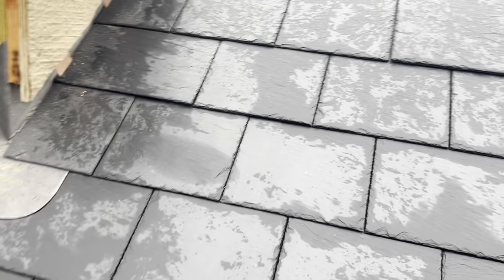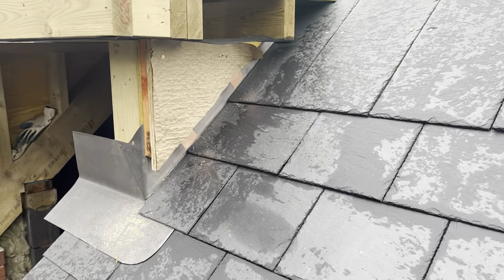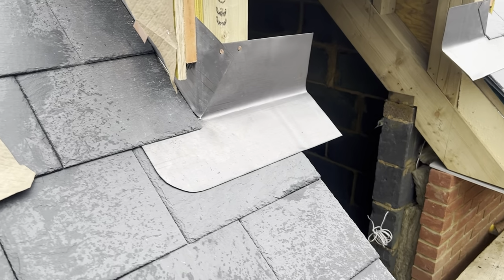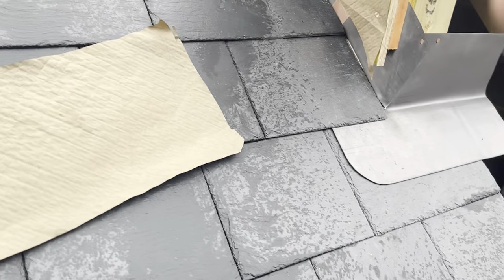So we're just in the process now of making these cheeks. Okay, so just measuring this cheek now. They're just core drilling inside, so I'm hoping that you can actually hear me okay. What I always do is draw it out on a piece of building paper, the right way, so you know you're going to knock it up the right way. Otherwise you could get down to where you're going to knock this up and think, oh, which way was it? It's so easily done to make a mistake. So I always draw mine out with all the measurements on there.